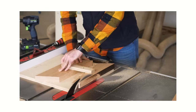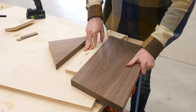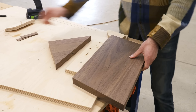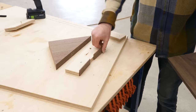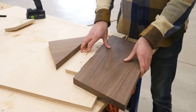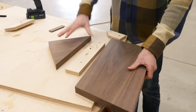The purpose of this tip is to let you do that same thing when cutting a taper. I cut a lot of tapers — the legs on this desk and this coffee table are examples where this would be useful. I normally like to use a sled for tapers, though this same principle works on a tapering jig. In this shot you can see I've got a quick sled set up to cut my angle and the taper drawn on my workpiece. I place two small shims — just under an eighth of an inch thick — sandwiched between my workpiece and the fence screwed to the sled to determine the angle. With that set up, I remove the shims, lock down the workpiece, and make the cut.